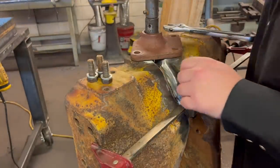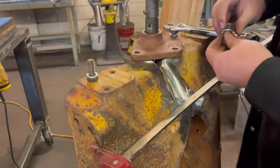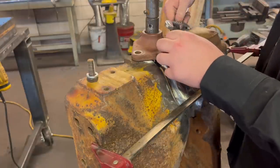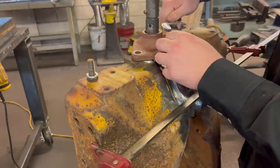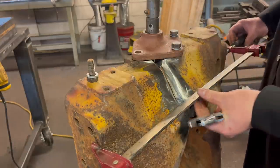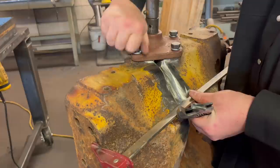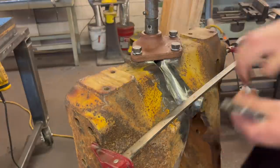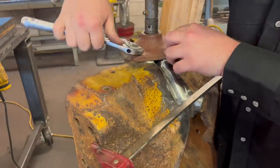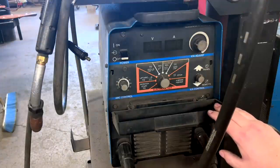Fit-up is a big deal. I need to make sure I'm welding this back together correctly so everything goes back together the way it should. What I'm doing is bolting down the front crank bracket, which aligns the workpiece — aligns the base cast steel back to its original position so I know everything will line up correctly when I'm done welding. I'm also checking my fit, making sure that V is ground all the way out and there are no super tight areas I can't get my welding rod down into.